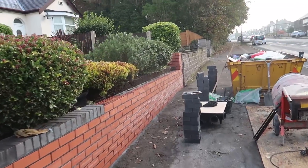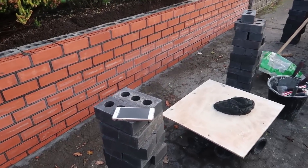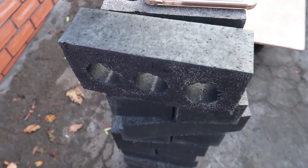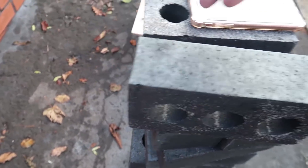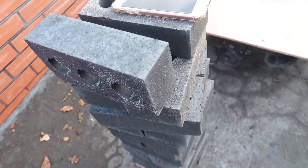Here we are on the final stretch. We've got our blues — finally, some decent blues. That's the trouble when you're doing brick on edge: you need all three sides good — this one, the back side, and the front side. You need them all square. Any chips on here and it's going to make your joints look rubbish.